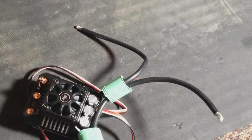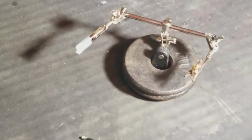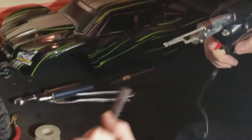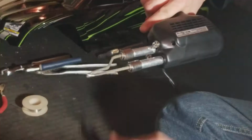You want to get a wire brush. It's my suggestion, a wire brush like this. And you've got the tip of your nozzle. Now do it with it off. You can also do it with it on, and when it's all hot, you want to clean the nozzle with a steel wire brush. You can use brass too, but make sure your wire brush is clean, with no grease residue, nothing like that.